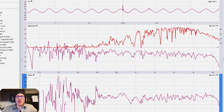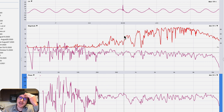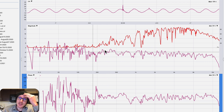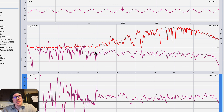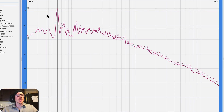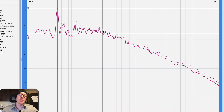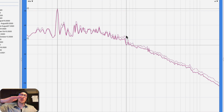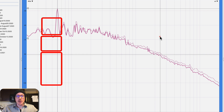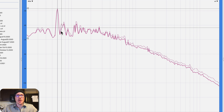Here's SMART, and here's the first measurement I took. I thought, is there a problem? The speaker sounds fine to me, but this measurement seems to say I'm missing my low frequency driver somehow. Michael said maybe there's too much noise, and I said let's take a look at the spectrum. Here is the noise floor out there in the wind on the street. You can see there's a lot more noise in the low end than in the high end. I forgot to store a measurement with the signal generator on, but it was about like this - you can imagine the signal was about like this, and everything below that there was just too much noise. That's why it looks like this.